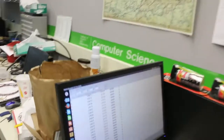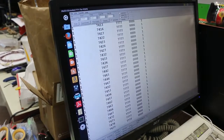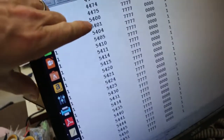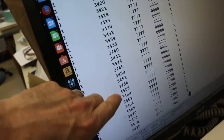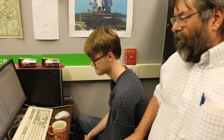He noticed that they're all X4XX — all the numbers have a 4 in the second digit. That would imply the 400 select line is flaky. The way the inhibit drivers work is you use that address line just like a one-of-three or one-of-eight type decoder. If that driver card was bad, then you drop anything where that four is a one.